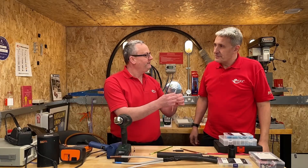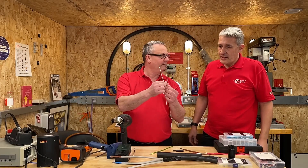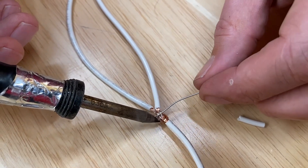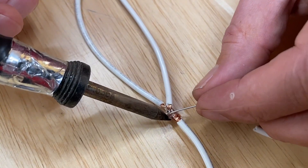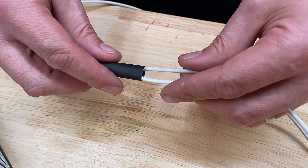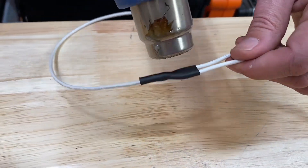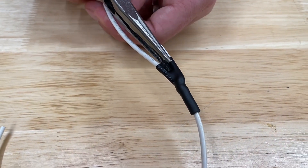What about this wire splice? If you wanted to make your own wire splice and branch off, you can create your own strain relief and moisture-proof seal in one operation. I've used a quite large diameter heat shrink, and while it's hot I've gone in with pliers to nip the little area in between where the two cables separate — that gives a fantastic seal. A good little hack.